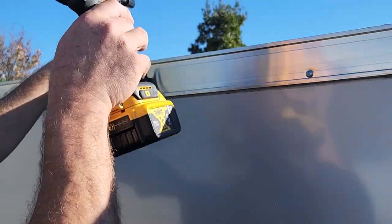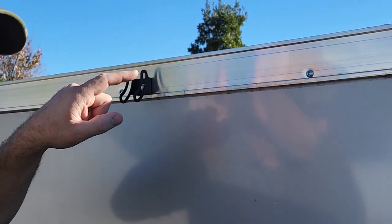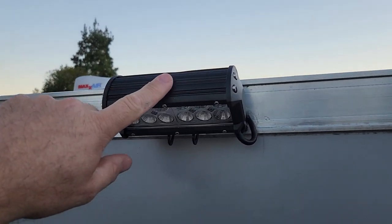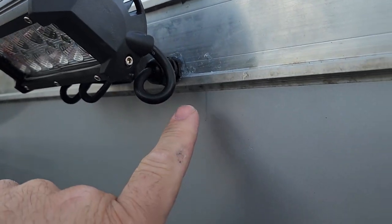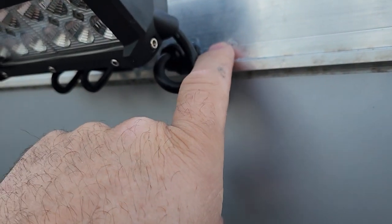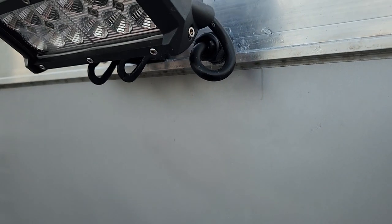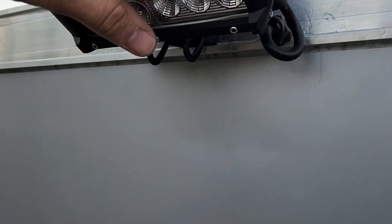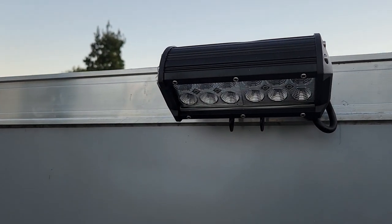Over here I marked a line where I want the wire - once the light is in here, it's about in line with the wire, so I want the wire to come through there. That's where we're going to put our through-deck waterproof fitting with the pinch washer so it's waterproof. We want to get right between the bracket on the inside since it only gives us so much thickness. We got it mounted on there - you can see the waterproof fitting going right through. We have our drip loop in here so water could drip off, and it's pointed down to shine the area.